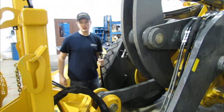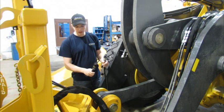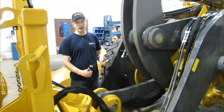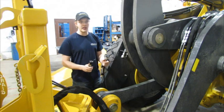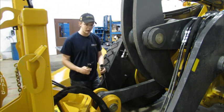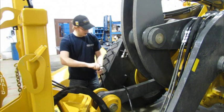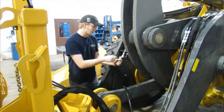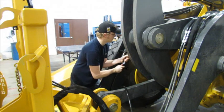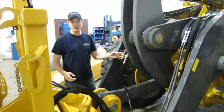If you've had your plow harness or entire plow sitting for any amount of time, you may notice there's some residual pressure inside this circuit, at which point you can plug both of these together and equalize it to hopefully dissipate it enough so that you can connect them to the front of the loader. The first one I'm going to connect is the rod side of the front post, which was at tank pressure and went on very easily.